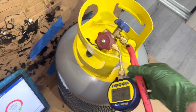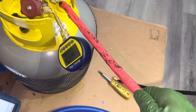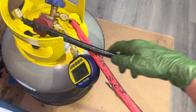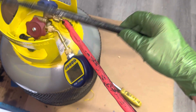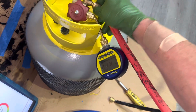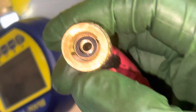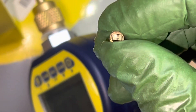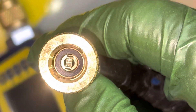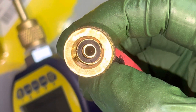I have it set up to one port and one hose. This is refrigerant hose and as you see it looks a little different — I was trying something here with an industrial adhesive, this stuff is really strong. For the gauges, I have removed the port. Do you see the size of the port? That's what it looks like for the vacuum port. This is what it looked like before — do you see how restricted that is? Those little tiny openings are what you have to try to move vacuum through, which slows you down.